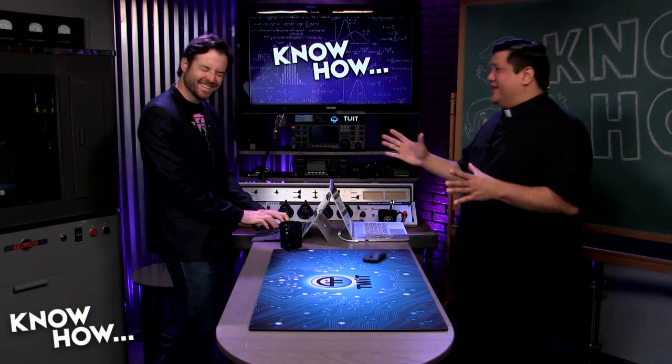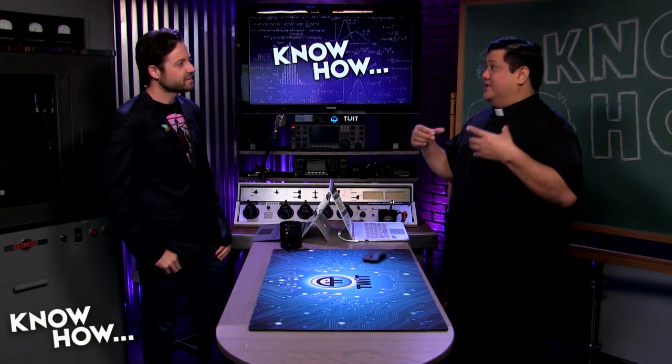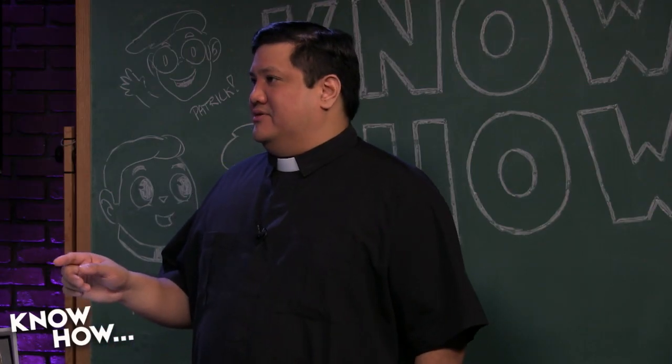Now, when we're doing this, the thing you have to remember about using that kind of memory is, again, as I mentioned, you've got a certain number of rewrites. So don't use them up. It's just like an SSD, right? You've got 100,000 or something like that writes, which sounds like a lot. But if it's constantly happening, if you code it improperly, it's going to go away.